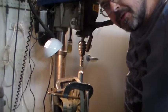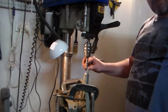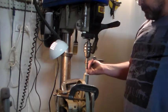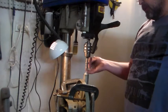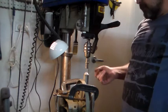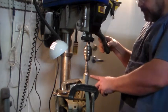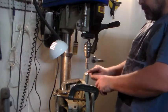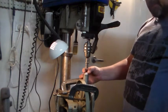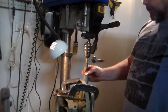Up here I've got a 20 millimeter carbide-tipped hole saw. What I did was take the drill bit that normally sits in the center of that out. The gap inside is roughly about 13 millimeters. I'm thinking if I can spin this up and bring it down and work it, I should end up with a nice neat cylindrical shape, maybe five, six, or seven millimeters long, with the hole in the center.